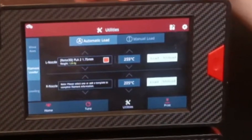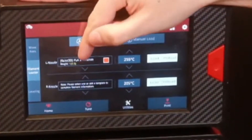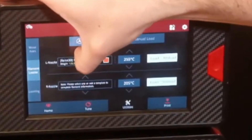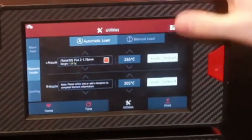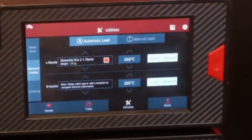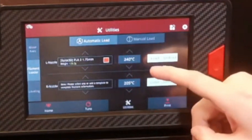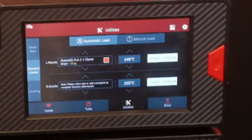In this configuration I can go ahead and either select or add in specific filament profiles. Once these profiles are changed, that is going to adjust the temperature. So if I go from ABS to PLA, it should switch for the profile. Or I can just press that temperature again, make that adjustment for the value, and then hit load instead of load sequence.